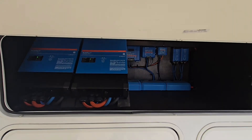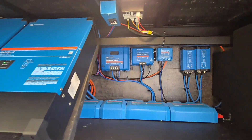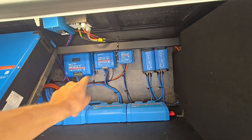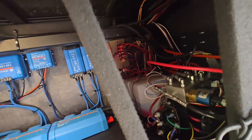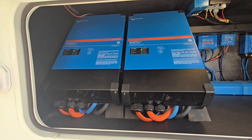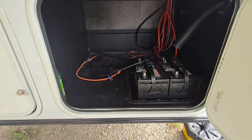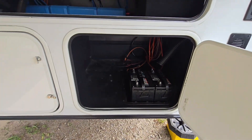I made use of this top front bay like I've done in some other of the Alliance Paradigms I've done. These 5000VA inverters - there's not enough wall space, so I had to build a wall to hang them on an angle. Down here we've got the Lynx setup - Lynx power in, Lynx shunt, two Lynx distributors. We've got three strings of solar, so three solar controllers. And we've got two converters making the 12 volt, even though there's no generator on this one. Really 70 amps should be enough to run everything, but they're cheap enough that we just put two in - because if the fridge happens to be running the same time you try to run the leveling jacks and there's some lights on, maybe it's more than 70 amps. We've got the two 5000VA Multi-Plus Twos, and then they go to the Victron autoformer. Those batteries down here are disconnected - we just left them there for him to haul to where he's headed next. He's got somebody he's going to give them to, so those are not part of the system anymore.